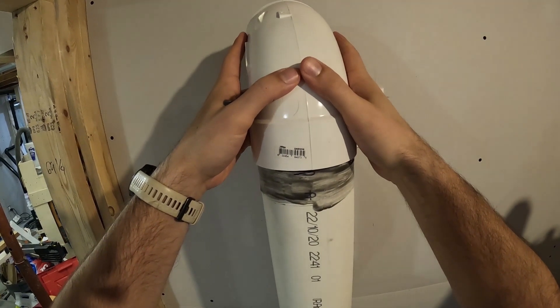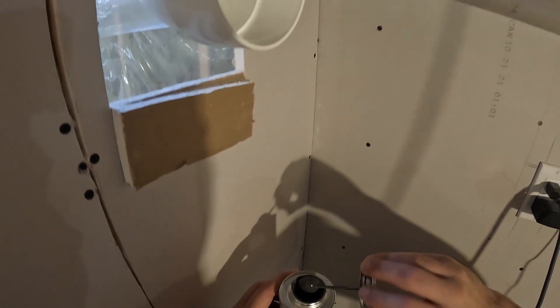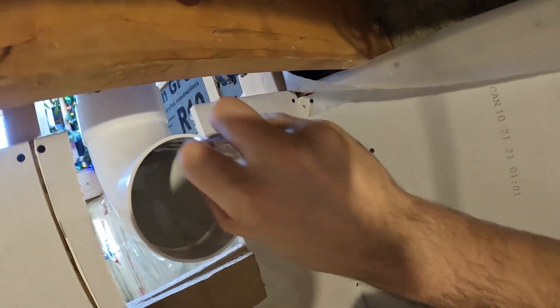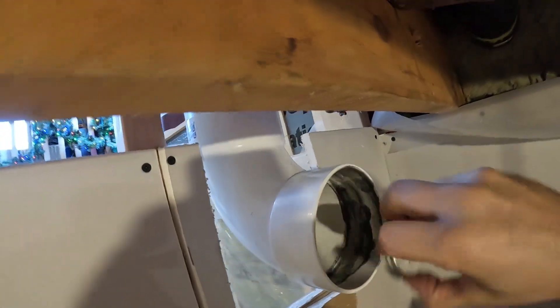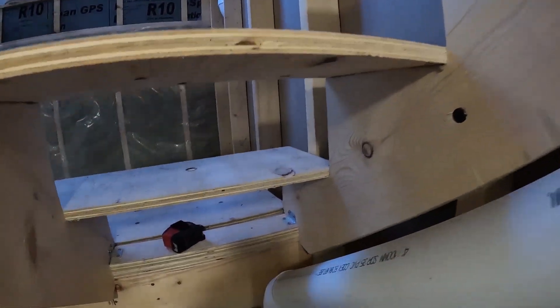You also have to find all the holes in your slab and the connections between the walls and the slab. I have a well access coming through my slab, so I made sure to seal that up as best I can with spray foam to keep it airtight so gases can't come in through that hole. I also have an unfinished bathroom where the drain pit for the shower is completely open to the underground, so I sealed that with foam and a piece of plywood in the meantime while I get the chance to finish the plumbing and re-pour some concrete.